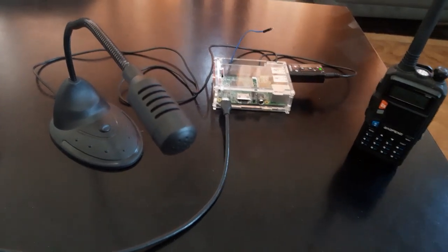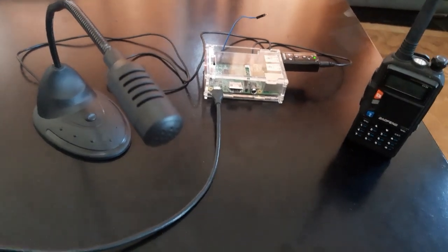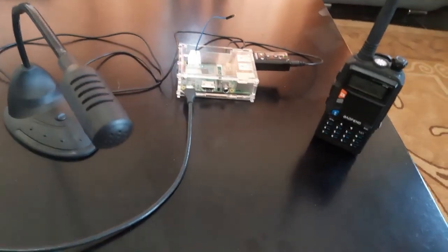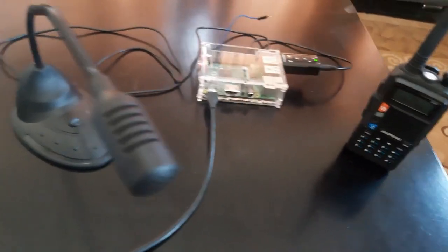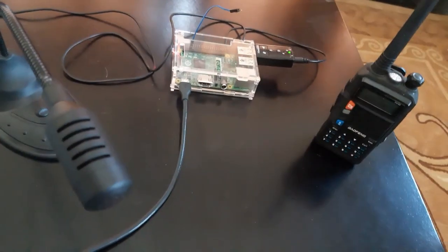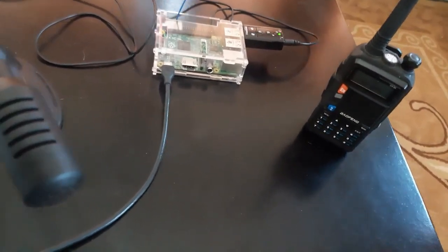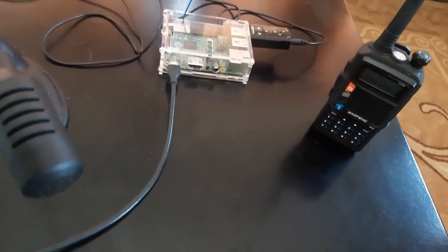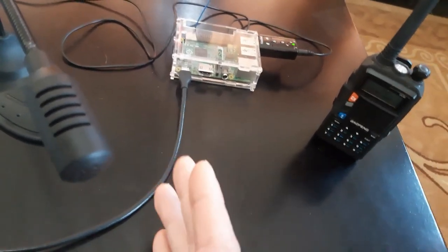Today is step by step how to make a live microphone FM portable transmitter, ranging from 75 MHz to 290 MHz. It's easy to stream your voice in real time through pin 7, GPIO 4. Just hook up a small wire to act like an antenna, and the optimal length of the wire depends on the frequency you want to transmit on. What you need: a Raspberry Pi itself.